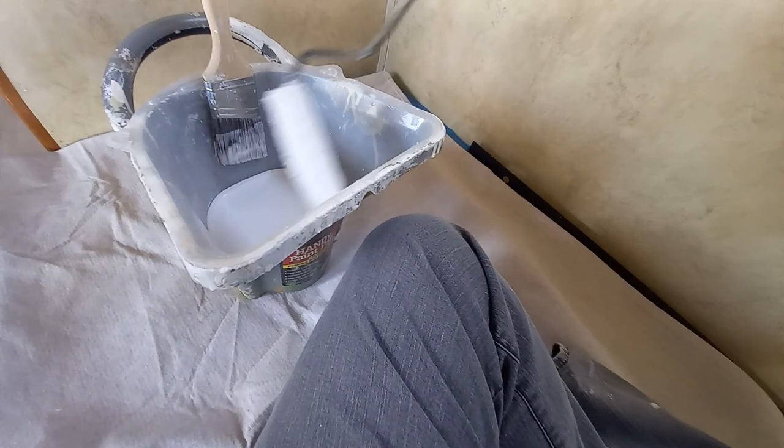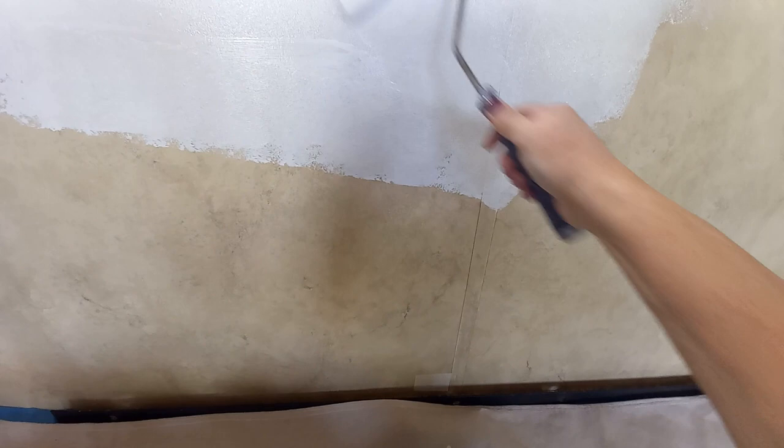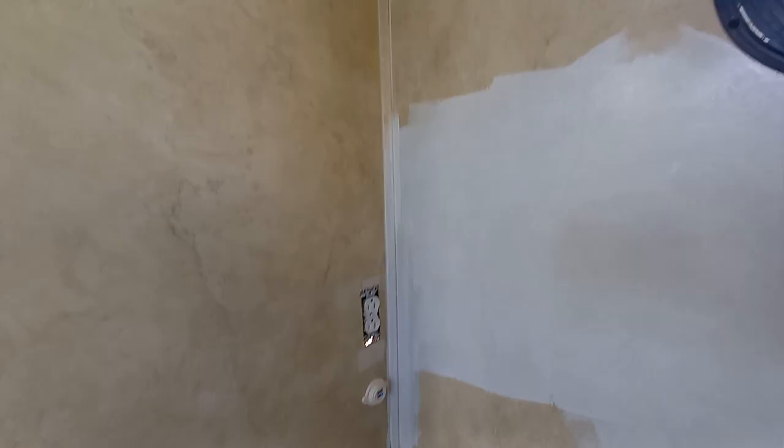Just make sure the first time it's got a little bit of paint stuck in that nap in the corner. I love these because they have a little corner thing — not that I'll use it much here with all the trim. Then I'm just going to come like this, and I like to just get rid of those paint lines. Make sure you don't have any lines — just thin it out, make sure it gets in all those cracks. Your first coat, you're not going to want to put on really goopy thick. This coat is just to get it to stick, basically — it's going to seal that. So that should be all it needs. Now I'm going to start going.